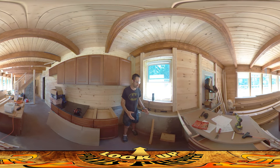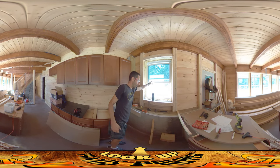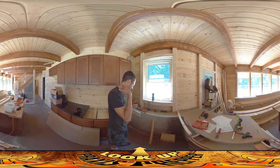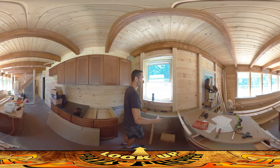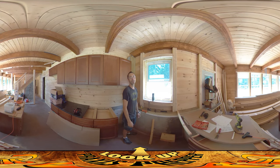The other thing this helps solve is that two feet was the dimension on all these counters, and if you slide the sink base right up to this wall it was always going to be a stretch to open and close this window. Given that I can custom build it, I know where the sink is going to terminate, and as long as the sink doesn't interact with this wall I can shove it over a little bit — giving me a couple extra inches to get up here and work with the window. It's still a bit of a stretch, but those couple of inches are going to help a lot.